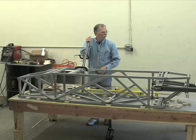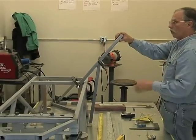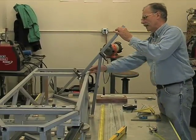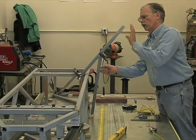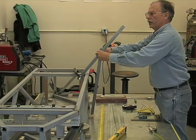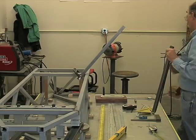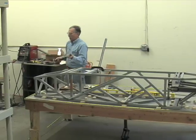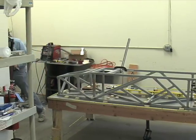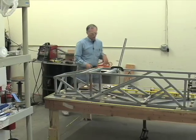Now it's firm. See that? Created a triangle or facsimile. Now this thing won't easily move. I could weld that, weld it, weld it, weld it, and now it'll be at the angle I need. That's all there is. Keep the geometry simple. Maintain the alignment by clamping force. That's all you got to do. Just that quick, just that simple.